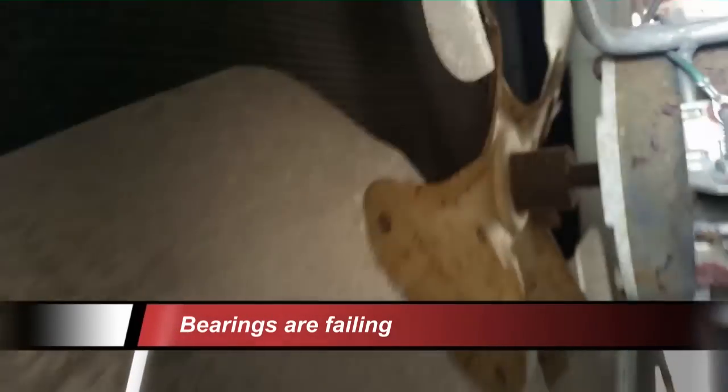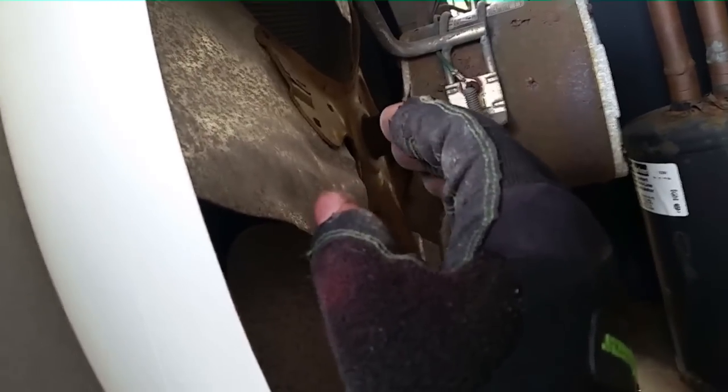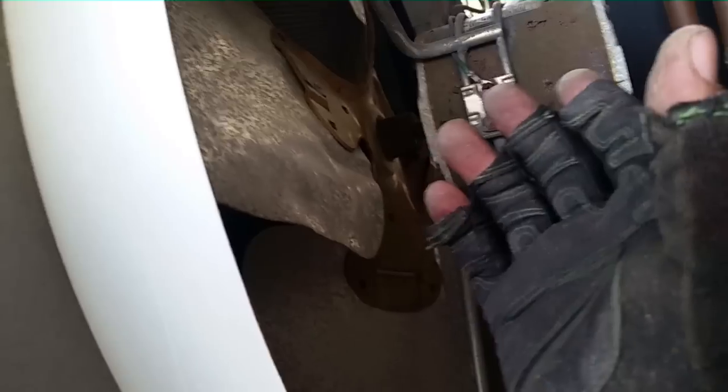Guys, you can see the condenser fan motor. If you look right here, you can see there's oil all over near where the bearing is, and on the back, same story. One of the condenser fan blades was bent, hitting one of these metal support brackets, and was actually bent backwards. Here it is, bent backwards, sandwiched up against that support bracket, so that's nuts. I don't think the motor has much life left in it. The motor's pretty shot, and the blade's definitely done for.